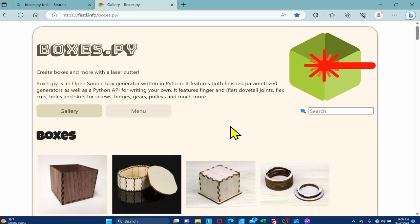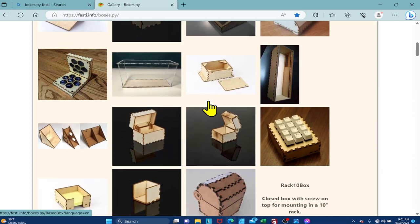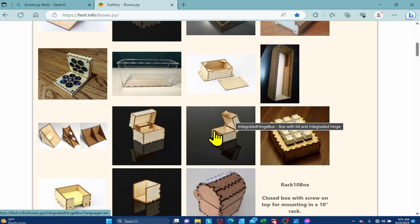We're going to use three different materials: some eighth-inch ply — in this case, two-sided Unisub with scraps laying around — some half-inch closed-cell foam, and some sixteenth-inch two-color sign plastic. We're going to start in the box generator before we get into LightBurn. This is my favorite box generator — I'll leave a link in the description. You can click on any of the box pictures to jump into the design module.